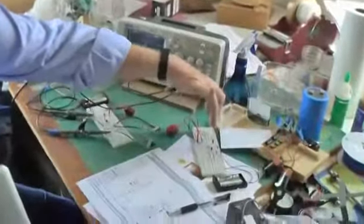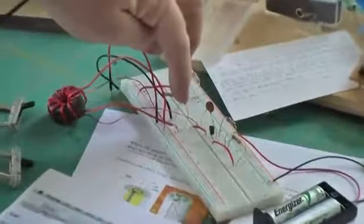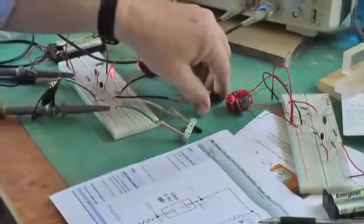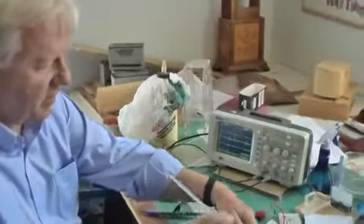This circuit is just another variation — here I've replaced the LED with a diode, so I actually waste less power there. I'm looking at the power dumped on the output resistors. By replacing the LED with a simple diode, I get more power dumped on the output resistors. So the name of the game is varying things and comparing the input power to the output power.